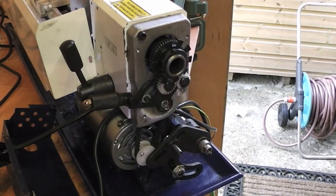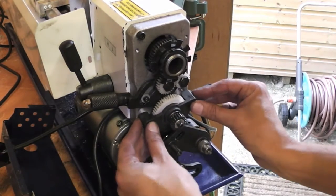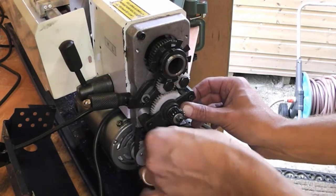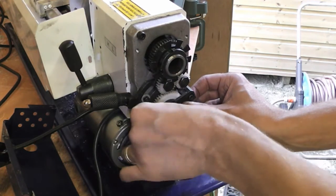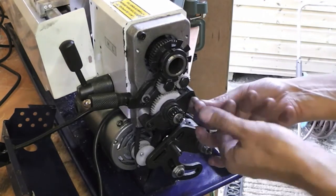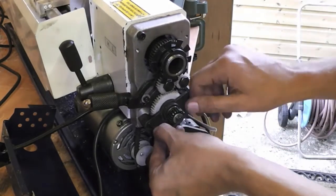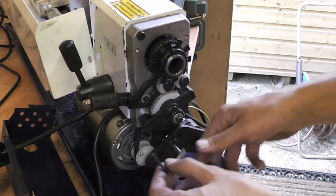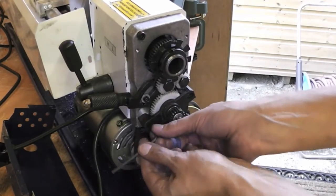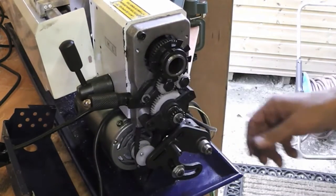That's my gear selector in. I've next got my drive cog for the gear selector. Simply snaps in there. And you see, if you do it in the right order, it seems relatively simple, he says. Basically, this side assembly is for running the lathe automatically, and for doing the threading. Don't want to over tighten these. It's a cast case.